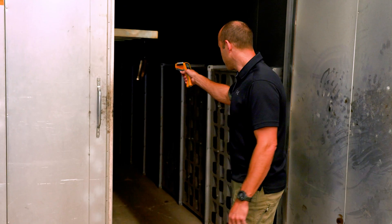So here's how you're going to do it. You need to be checking your part metal temperature with an IR thermometer, because you need to get the part up to temperature for a portion of the time on the cure schedule. If you don't get the timing right, you can risk all sorts of problems ranging from inconsistent looking finishes and even delamination of the coating. So here's a simple ballpark method for evaluating a partial cure.